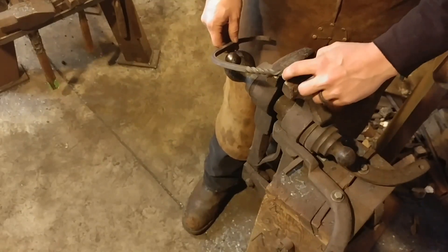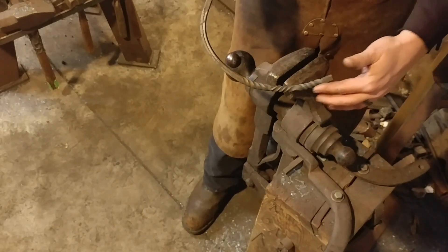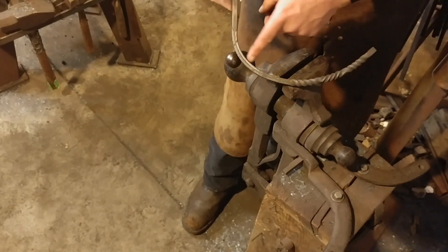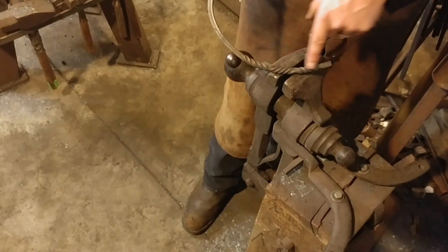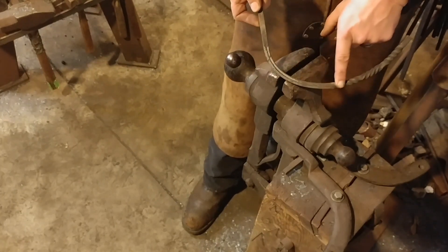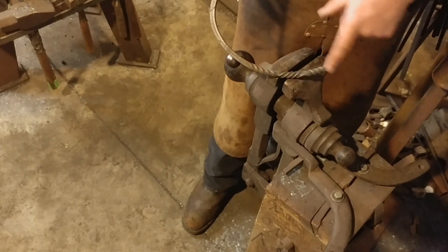This is an alternating twist, and one of these has a chisel line cut in one side of it. A regular twist, all in one direction, may yield a different result. But as far as my conclusion, that is a tighter bend than what the straight bar shows. So I would say that a twist would almost improve the original quality of the bar — that twist is certainly not a weak point.